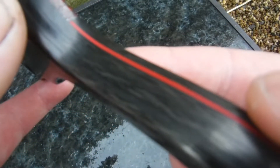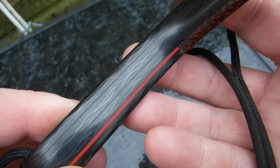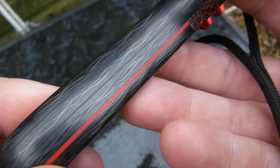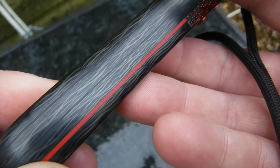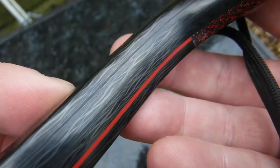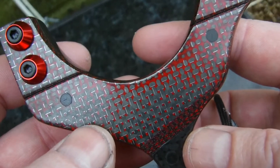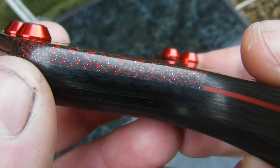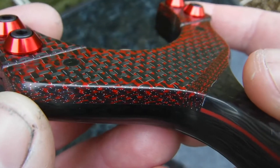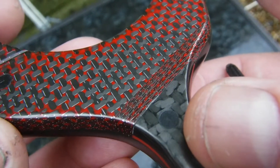It's that theme I've been going with recently because of the quality look and the strength of it. You can see the two layers of G10 and the carbon layers, and then we've got a layer of red G10 just to back off from this 3mm piece of carbon on the front. So you've got seven layers along there, 14mm frame overall - it's a nice thickness. The face is this lightning strike white carbon which has red and black carbon with aluminium through it, which looks really good. I turned a piece of it on its side to use as the spacer, which I personally think looks really really good.